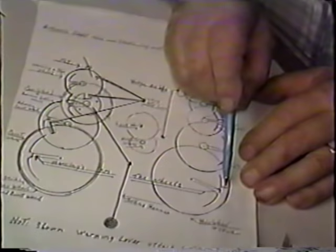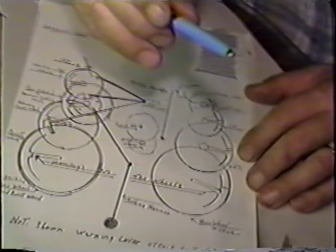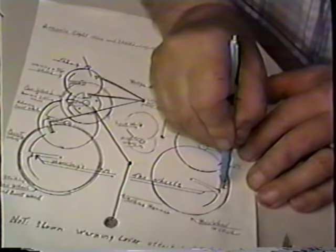What I do is I use a marking system. On my first wheel, which is on the time side, I'll put a horizontal line just with my scribing pencil. You can use any pointed object made of steel or whatever. This happens to be a carbide pencil. I use that quite often. Make a very tiny scratch mark signifying number one on the rim of the wheel.